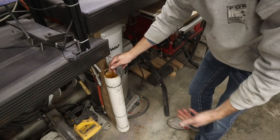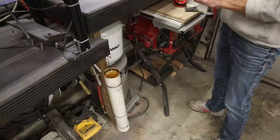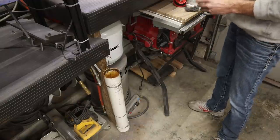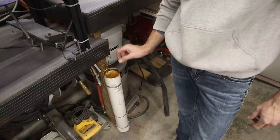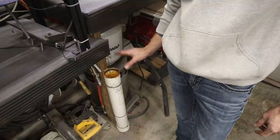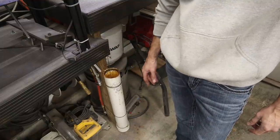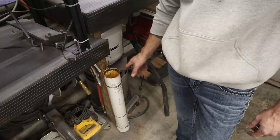So it's etching nice and even. So I'll just let it do its thing for a little bit. Not too long, we don't want to etch it too long. Ferric chloride has a tendency to etch the 15 and 20 a little bit also. So, you know, I want the 15 and 20 to stay bright. So I'm only gonna etch it for a little bit, and then I'm gonna clean it up, and we'll probably do a coffee etch to darken the 1084.